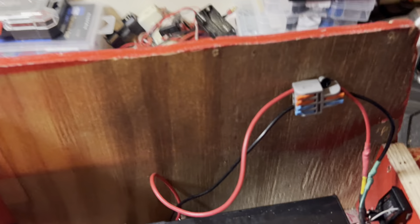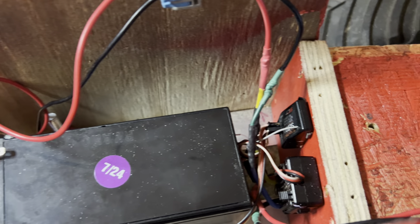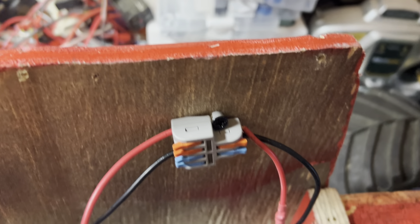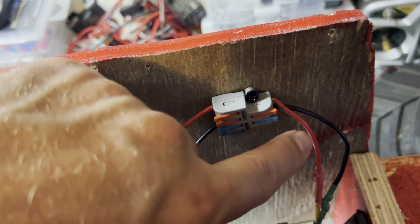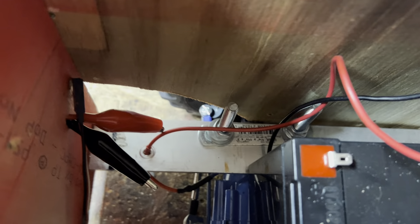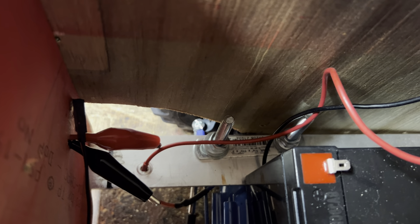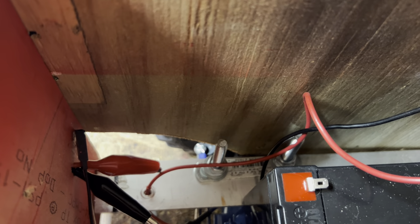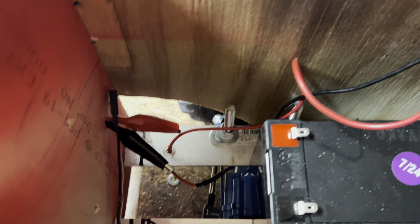Here's how I'm going to power this whole machine. As you can see inside there's a 12 volt battery, the ESC — a 1060 — and a Spektrum receiver. Here's a little box thing where the ESC wires go in and then come out and go down to the motor. The motor is a 27-turn stock Clodbuster motor that comes in every Tamiya kit, and it should be just enough power to run this machine.